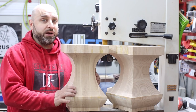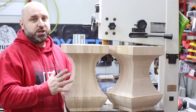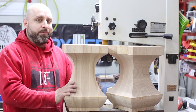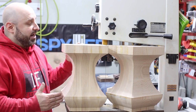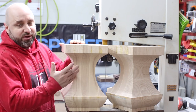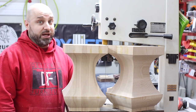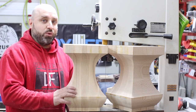That's it for compound cutting on the band saw. As you can see, it's a relatively easy process. The key is to take your time with the cuts and have as few pieces to tape back on as possible to keep it steady and stable. I used a quarter-inch 6 TPI blade and it cut right through like butter — no problem whatsoever. All that's left is to sand them down and get them ready for the table legs. If you have any questions or comments, leave them below and I'll answer them all. Thanks very much for watching — see you next time.